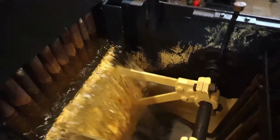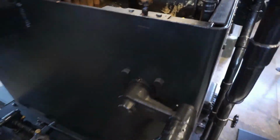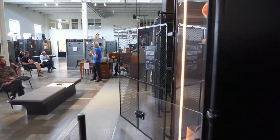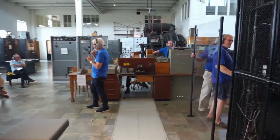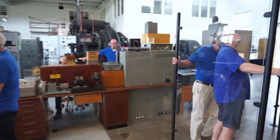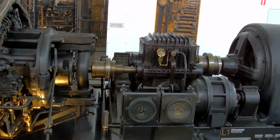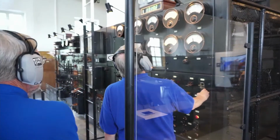Okay. As we are going out on the antenna, we'll go back and work a little with the control resistor, so the frequency will be constant when they key the transmitter. And then we are also using an antenna tuning coil to maximize the power out on the antenna.